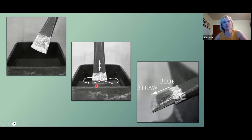And at that point, well, let me back up one. You're going to do this to the count of 6 to 10 for something this thin. If it was fatter, you know, maybe the count of 12 or 1 or 2 more. So the count about 6 to 10, you're going to make the figure 8 up and down, and then you're going to bring it to the side of your anvil. And you notice this is way off the side of the anvil. You do not want the anvil sucking your heat, because what you want is your heat to get sucked down into the edge you just cooled so that we can temper it.